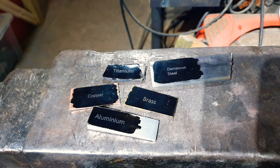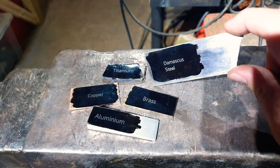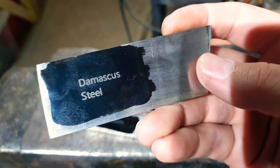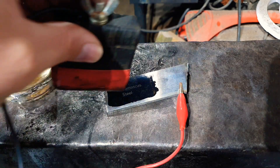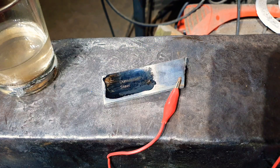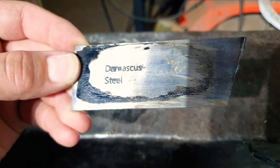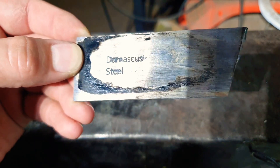Alright guys, we've got our test pieces all done. I'm going to start off with the Damascus steel. We know that normal steel will etch and that stainless steel will etch, but I'm curious to see how well it will etch with an alloy between two different steels, forge-welded into one. This has not been etched in ferric chloride but you can make out in the light there are definitely two different types of steel there. We've got a positive clamp hooked up, some salt water on the applicator — turn it to etch, and let's see what happens. That's the etching done, we'll give that a wipe and now try marking. After cleaning with acetone — yes, as expected, that both etched and marked without problem. Around the A and the M of 'Damascus' the nail polish was peeling up a bit so it did leak through, but that is definitely an etch and that is definitely a mark.